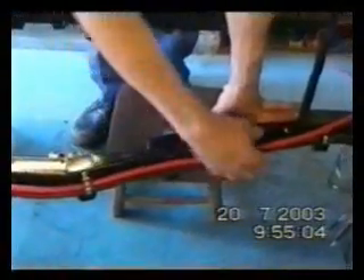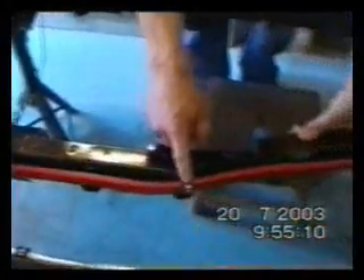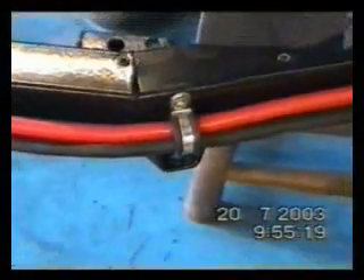Recent jobs have been to put the wiring in. It goes down the inside of the transmission tunnel, held in with rubber-lined stainless clips. I'm using stainless steel rather than plastic because it could get quite hot down there and I don't want any plastic ones to melt, so the stainless will hold everything in securely.